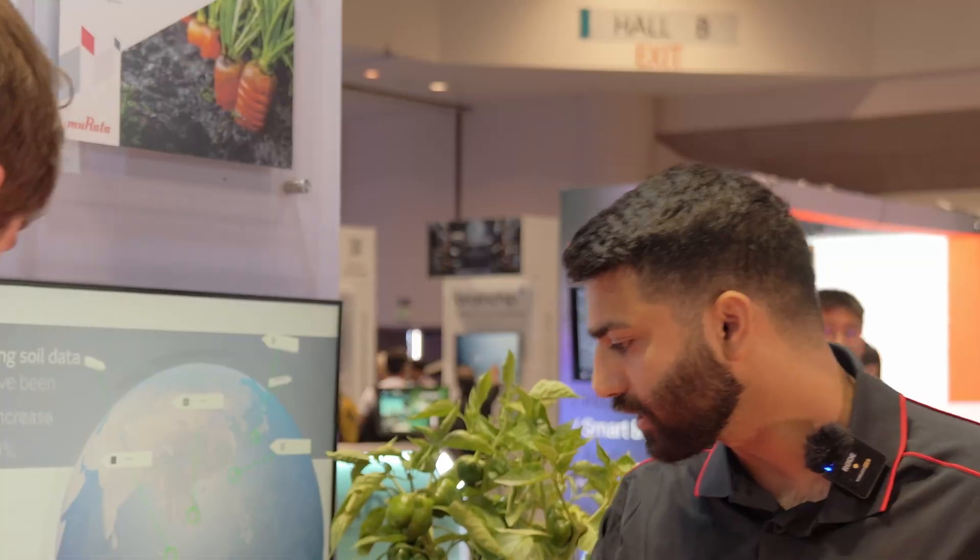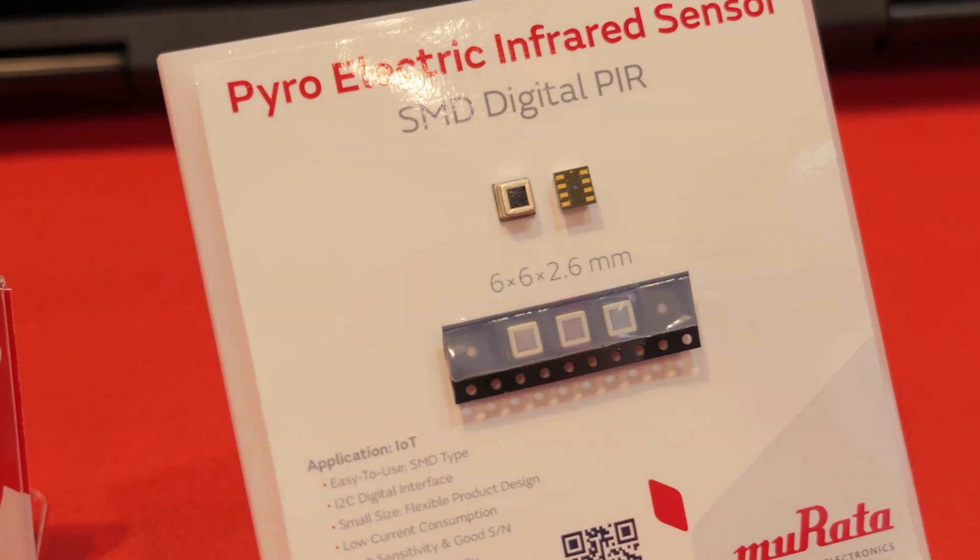The biggest motivation is form factor. You open up a lot of these products, go to the PCBA, and the only component that is leaded is the PIR sensor, and they have a really protruding lens design. Having a reflowable sensor allows you to cut process costs — no lead cutting, nothing to do with leaded sensors. Everything's SMT. The other thing is the low Z height, which is quite lower than a lot of the leaded sensors.